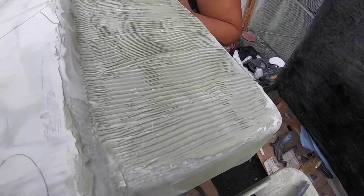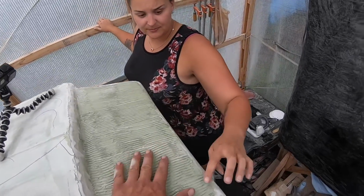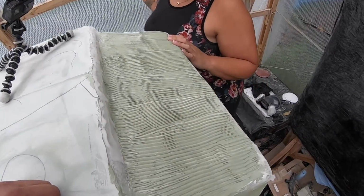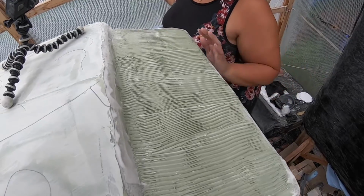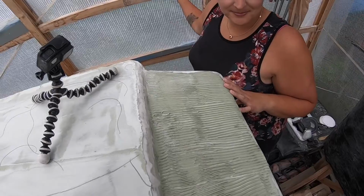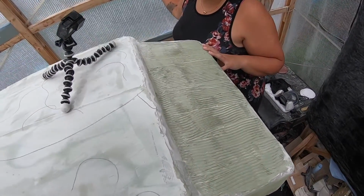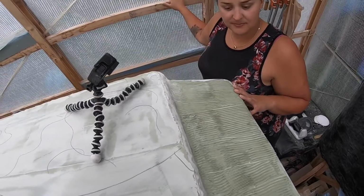The whole theory behind the serrations is when you're sanding this flat now, you're only taking off the tops of the joint compound, not joint compound, fairing compound. And then afterwards you refill it and it should be pretty flat at that point, but you're not sanding off as much material, basically half the material. That's kind of the premise behind it.